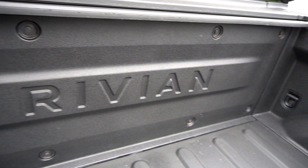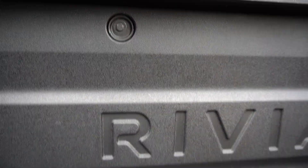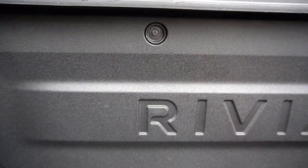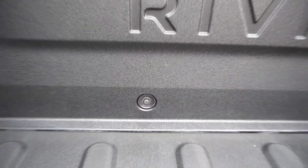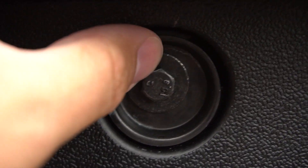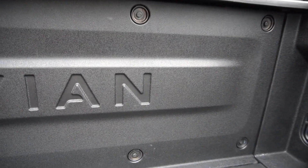This is the cab wall — I popped off these plastic covers here and I'm leaving those exposed because I want to show you something I discovered: the bolts are not centered in those holes, and they're not consistent either. Behind each bolt is a bigger hole, and these little metal cups and the washer allow for some misalignment. One of the things I'm going to do in my design — and I can do this because the 3D scan is close enough — is accommodate that misalignment so that other trucks assembled a little differently don't have a problem.